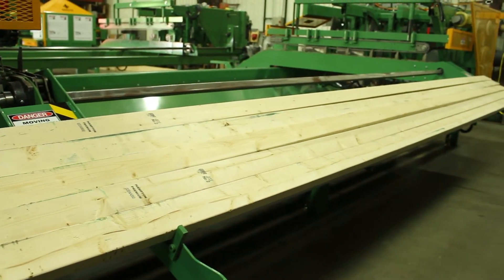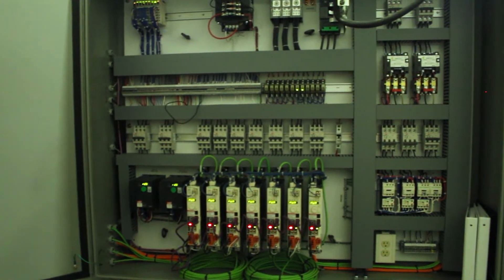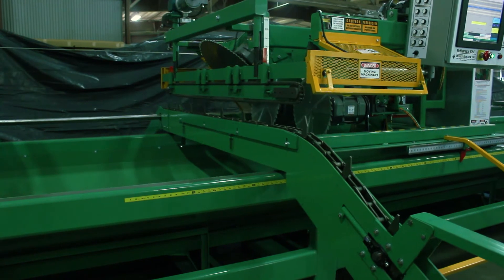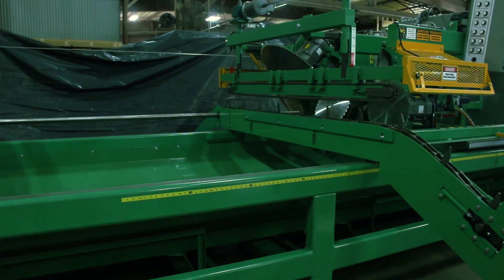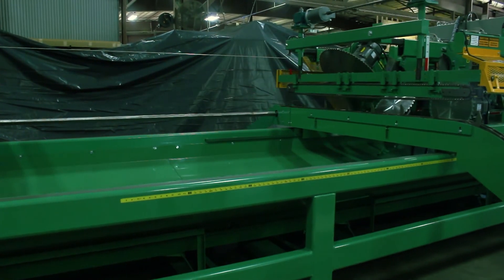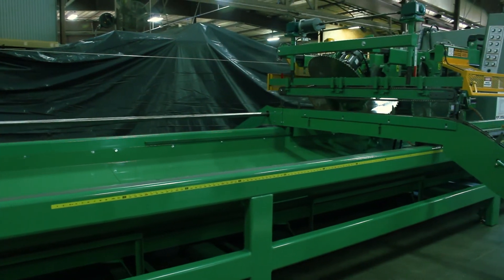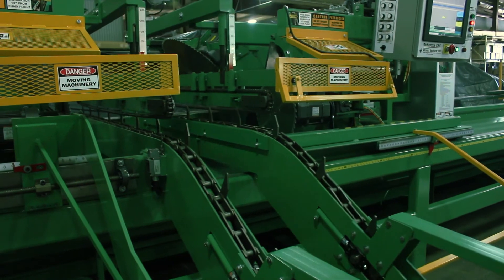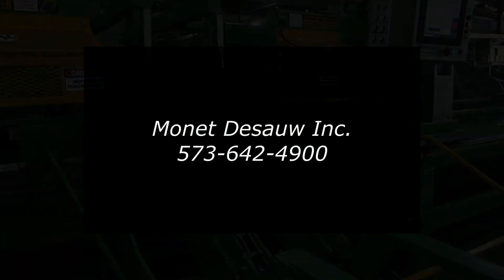The DeSawyer ES has a servo option with servo motors providing speed and accuracy. A servo motor has an advantage over an AC motor due to its ability to move at high RPMs under constant power while maintaining its position. It has two cables connected to it — a power cable and an encoder cable — and with built-in encoders, the servo motor ensures accuracy whenever it rotates.